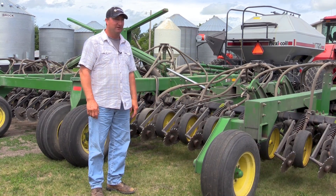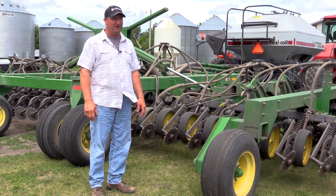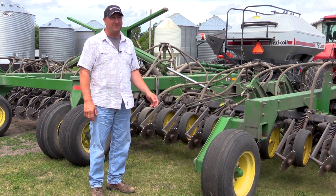It's a 1997 model. We bought it from a neighbor who no-tills everything too. He had the star closing wheels in the back for wetter, heavier type of ground — they provide a better closing system for closing the furrow up afterwards. It already had some no-till experience, so it was already kind of set up for us. The drill, the air cart, and the tractor all came from three different places, so they weren't married to each other. That was the learning curve on our part, but we dealt with it and made it work fantastically.